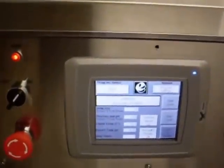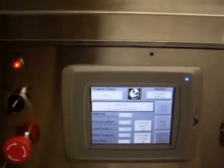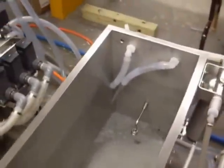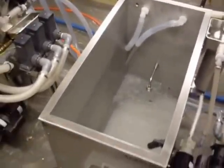After that cleaning step, we're now returning the fluid, draining it back to the alkaline storage tank. It takes about a minute and a half, and we give it a little extra time on the drain to let the fluid in the bottom of the process tank drain completely. Once the tank is drained, the PLC cycle continues on.